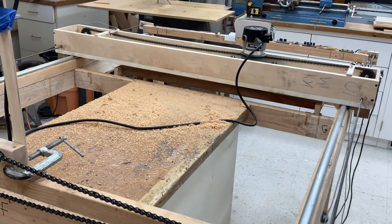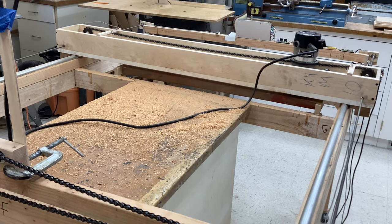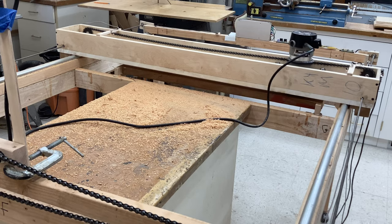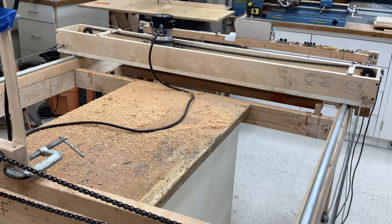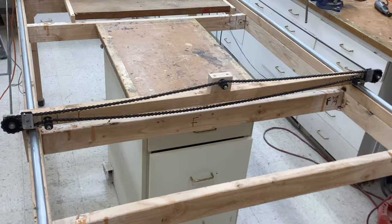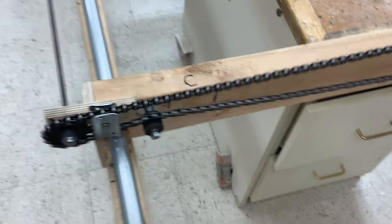With the new drive at full speed, it took only a few seconds for the router to travel from one end of the sled to the other, and it could still go as slow as before. I modified the program so the router only cut in the proper direction: when the router reached the sled bottom, the sled drive was backed off about a turn, and the router then drove to the top at maximum speed. The sled was then advanced for the desired cut width, and the router drove to the bottom at cutting speed. These changes made a huge difference in the flattening speed and made the cut much smoother. I also replaced the bevel gear transfer with a chain drive, eliminating two bearings, the transfer shaft, and the four beveled gears.